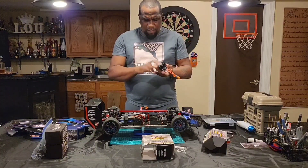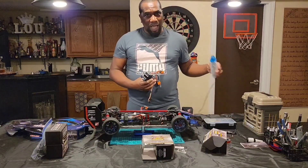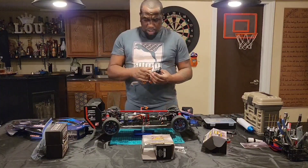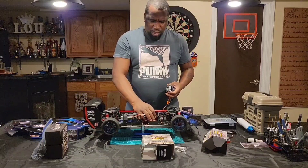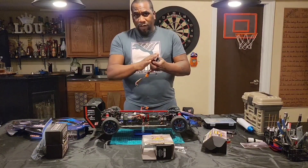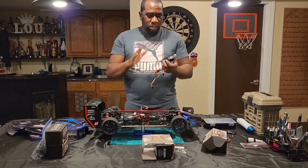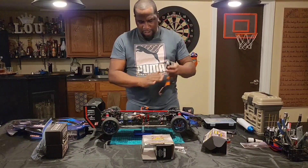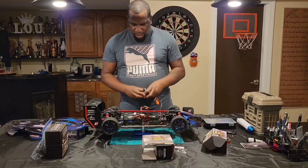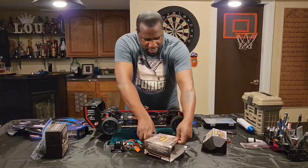What I'm gonna do is double-sided tape it from here down to here — that's why I got my heat gun. If you double-side tape something, especially something that's important, you heat up the area, clean it real good with alcohol, heat up the area. Same thing with whatever you're taping down — you clean it real good with alcohol, heat up the area, and put it down. When it cools, the adhesive will stick very well. So that's what I'm gonna do today with my ESC.